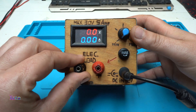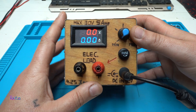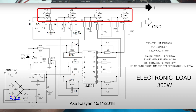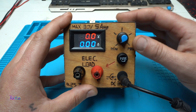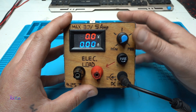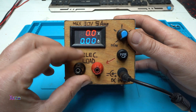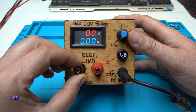For those who don't want to wait for part 2 where I will explain the whole circuit and how I made this — here is the schematic. The main chip is the LM324, which can control 4 MOSFETs. Right now on this project I'm controlling only 2 MOSFETs, that's why I have 5 amperes. With 4 MOSFETs you get 300 watts — that means 10 amperes at 30 volts.